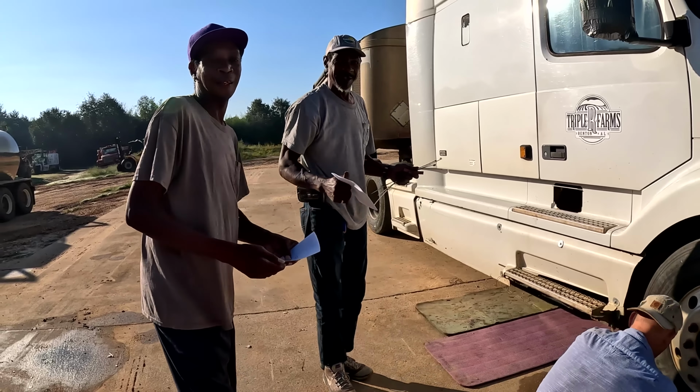And here's your tip of the day right here. This is something that I do on my farm that's really helpful when you're changing this combine around. We've got to change it from milo, soybeans, wheat, and corn. I hate to say this, but I have never calibrated my sieves. Now that I figured out how to do it, you really need to do it pretty much after every crop, because that was the problem.